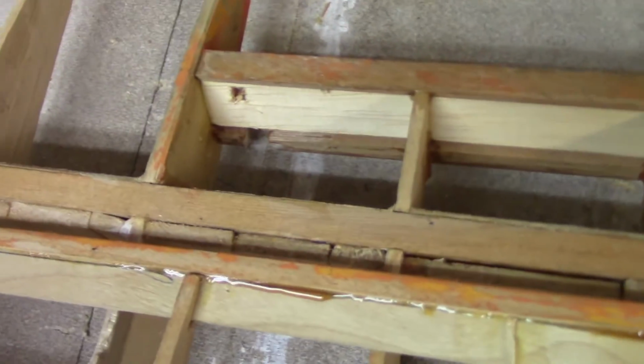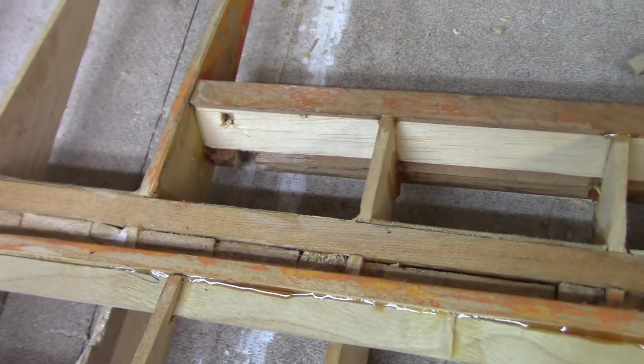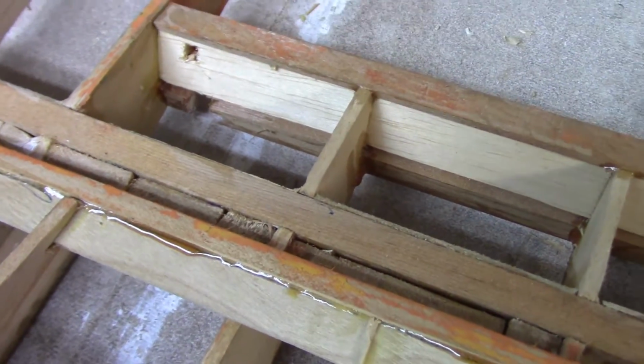So I will be making, so I'm contorting my arms strangely. I will be making attachments out of marine grade plywood, 1/8 inch. I'll glue 3 of them together, so it'll be 3/8 wide and a 1/4 inch high. And those will get glued back into the trailing edge of the wing, the actual trailing edge of the aileron wingy part. So that's going to go back in the same position that these were at.